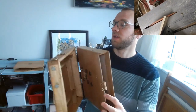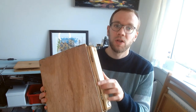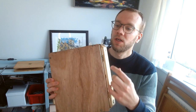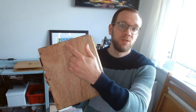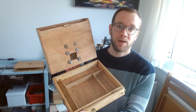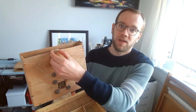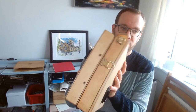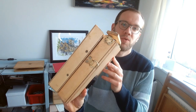To connect these sides I use mitre joints — I cut them on a bench saw, but you could just as well do an end joint, just have to be careful with measuring. I've fixed it all together with screws at each end. Having done that, you can cut some 3mm ply — you can see it's about 3mm thick — to the size of your box, and that simply screws or tacks down all around the outside. You want to make the panel that you're painting on a little bit shorter to enable it to sit there. The back ply — the ply which is sitting where the tripod holds it on the bottom — that's approximately 10mm ply.